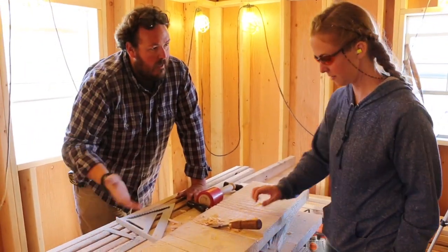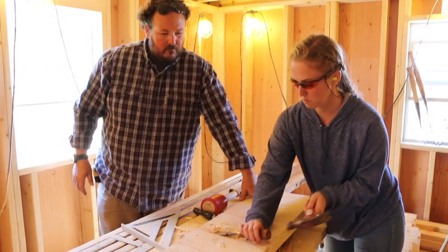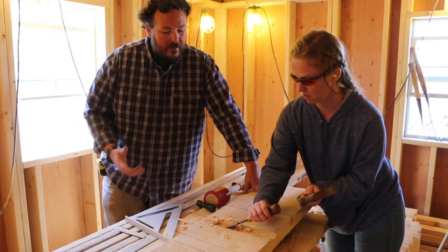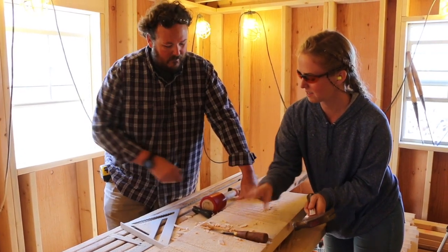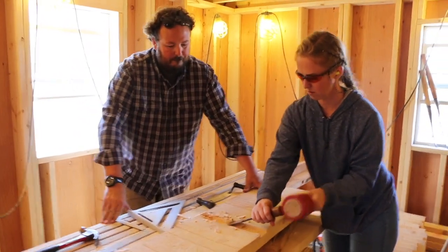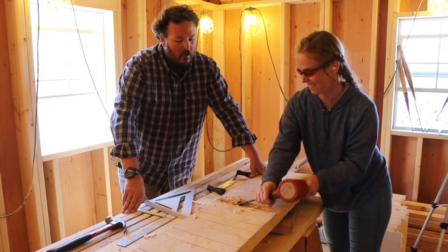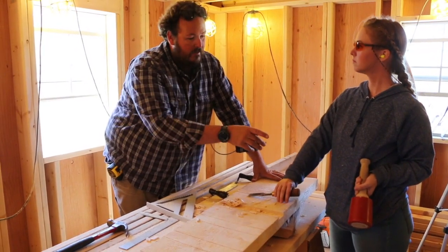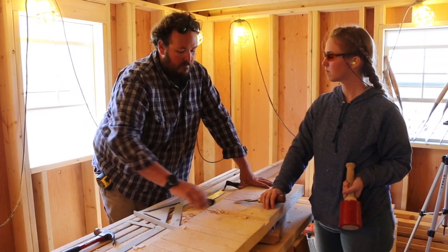So try the other hammer. I just want to see if you can feel a difference. Oh, it's like my hand is actually absorbing the shock instead of the hammer tool. Yeah. Now imagine you had to do this all day long. It makes this hand hurt a little bit. Now try. Much gentler. Well, what I noticed is that you're making a lot more progress because of the weight of that. It's driving that chisel a lot further with each blow.